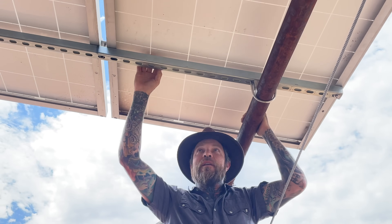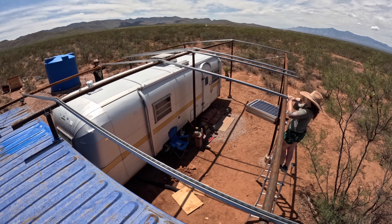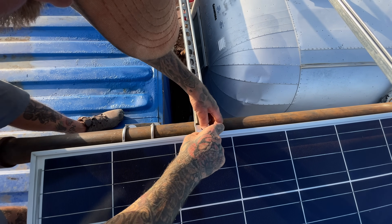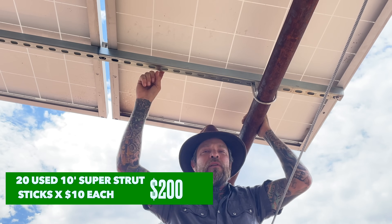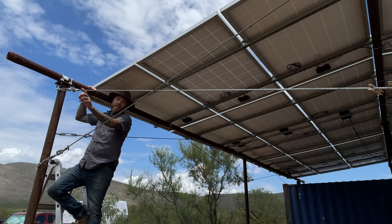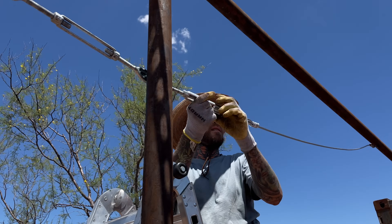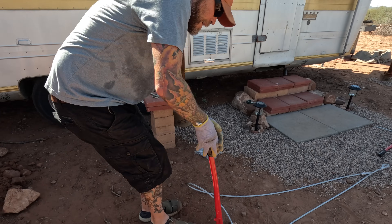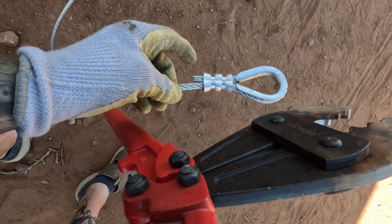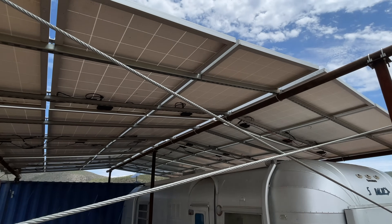We got a great deal on pre-owned 10-foot galvanized unistrut sticks — about $10 a stick, 20 pieces total in this array. We also added tension cable cross-braces with swage fittings and turnbuckles before putting all the panel weight on top. This stiffens everything up so it doesn't sway in the wind.